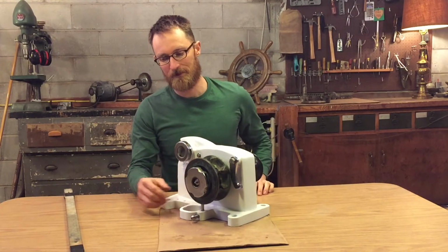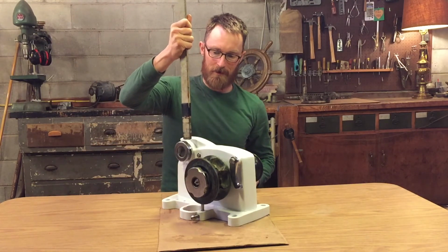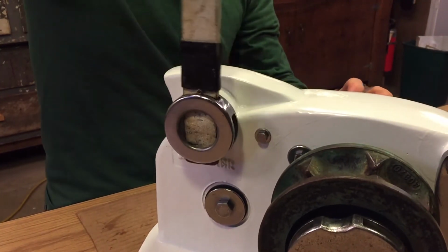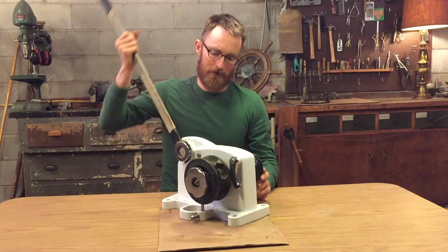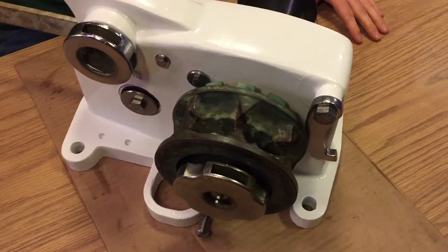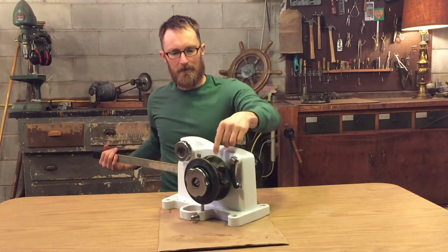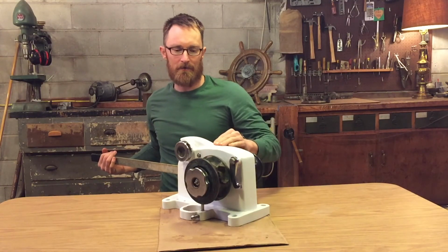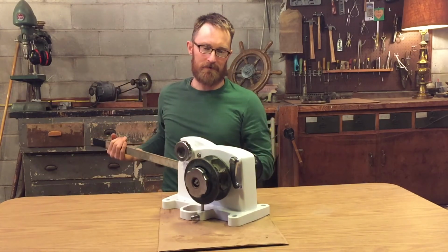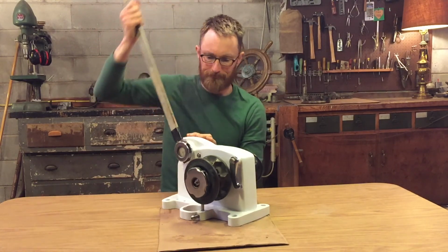Take the pawl out of position. Then, using the control arm, it's good to start at the upper operating spindle. This will give you the most leverage. If you need to take up anchor faster, you can slide over to the other side and you'll go twice as fast. And you'll note that the gypsy will take in chain or anchor rode in both directions that you're using the control arm. That's a really good feature.